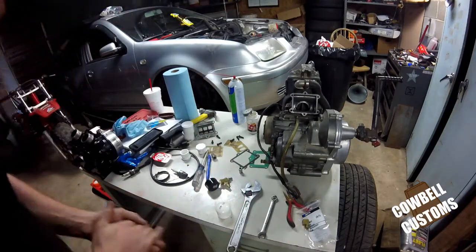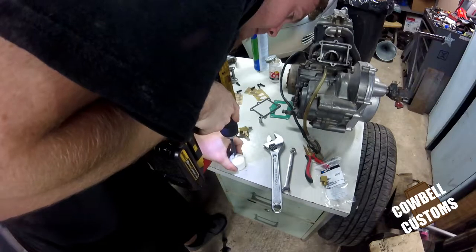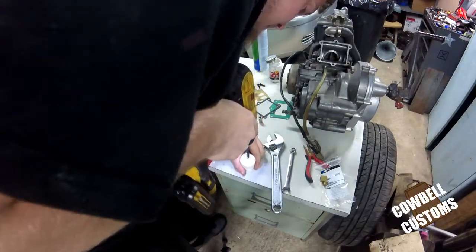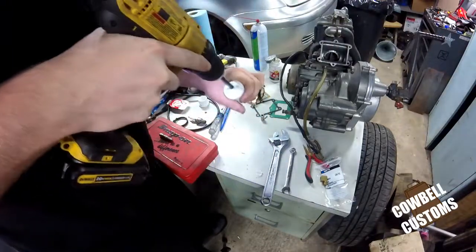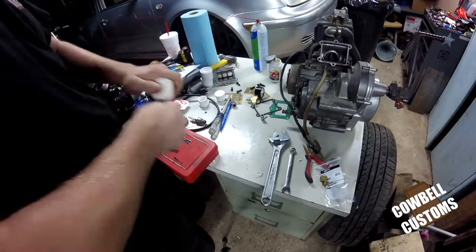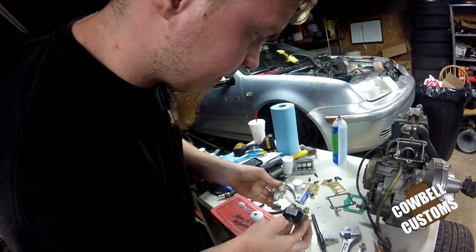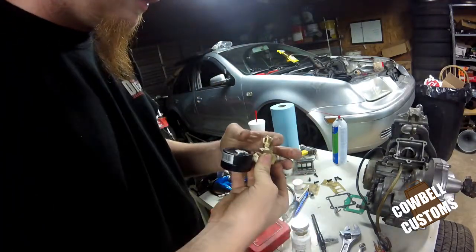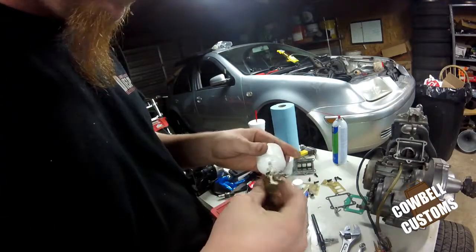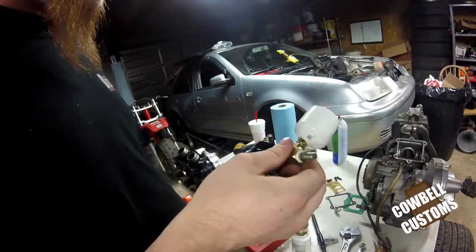I guess I got the drill. Top of the cap — 21/64th drill bit. I could probably do this in a drill press but whatever. Now, tapping is probably not 100% necessary; you could probably just use the brass fitting and just get it in there. Get a little bit of pipe dope here. My problem is this stuff is starting to dry out a little bit, getting a little hard to manage. That end's done and done.